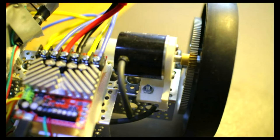None of these challenges are easy, but the current state of electronics — what you can buy, what you can get from China, and what existing software exists — enables you to play in this field. Whereas perhaps 10 or 20 years ago it wouldn't have been so easy or even really possible. This is basically the whole drive of the robot. I discovered the gear motors I was using when it became 15 kilos would no longer work on carpet — give it full power and it would just sit there stalled. So I upgraded to 20-amp stall motors with 10 foot-pounds of torque, and nothing really stops it anymore.